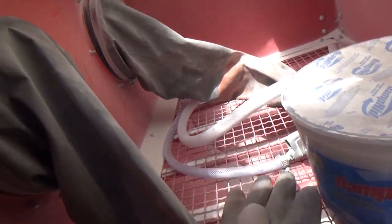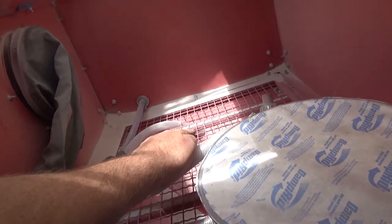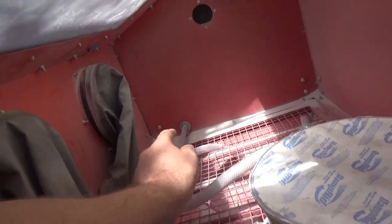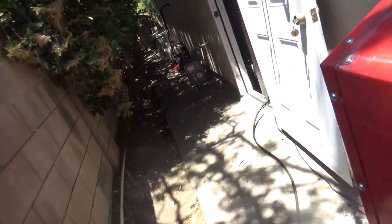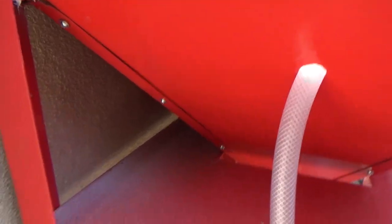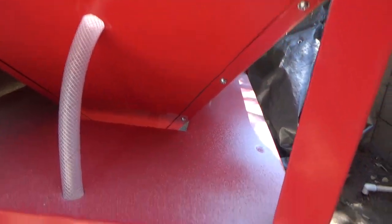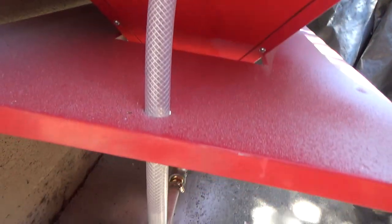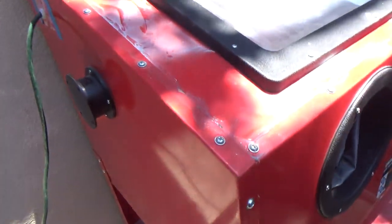I tested this out before and even though I caulked a bunch of locations, it is still leaking — even up top here, same problem, still some spots. So when I'm using this sandblaster, I still use a respirator. I have my water absorption material inside, which keeps my media nice and dry so it'll flow. The tubes route from this side through a hole punched in the side — I put tape over the old hole on both sides. There's not too much leaking around the tube because the hole is pretty much the size of the tube: seven-eighths of an inch.